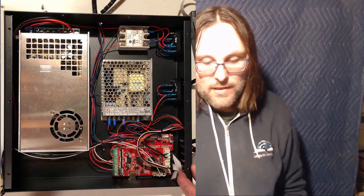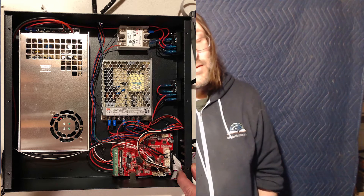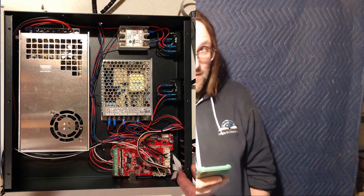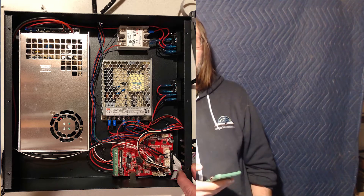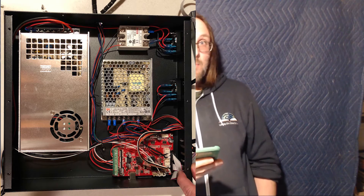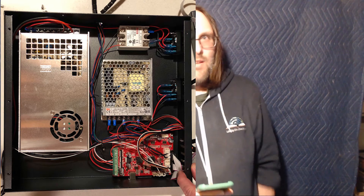Let's see what's inside that control box. If we look at this picture, we can see that to the left is the larger of the two Meanwell power supplies — the 400 watt. The little silver box to the right is the 100 watt. The smaller one works as a switch to turn the SSR on or off and basically turns the main power on to the heated bed. That SSR in the top right corner is why the bed can get so hot so fast despite being so big. In the bottom right corner is the control board — a basic RAMPS board that controls all the steppers and printer motions. It's quite standard, not 32-bit or anything fancy, but it is the larger size.